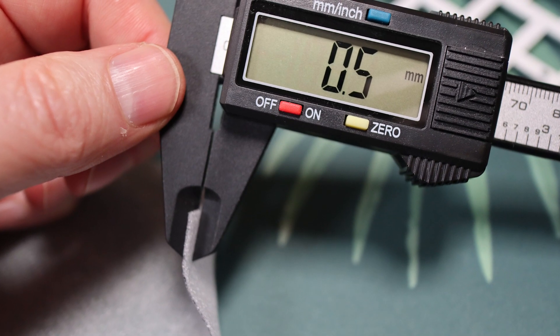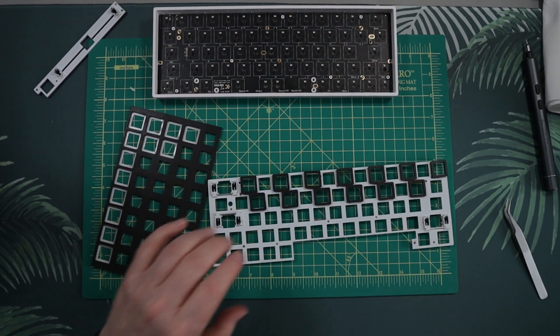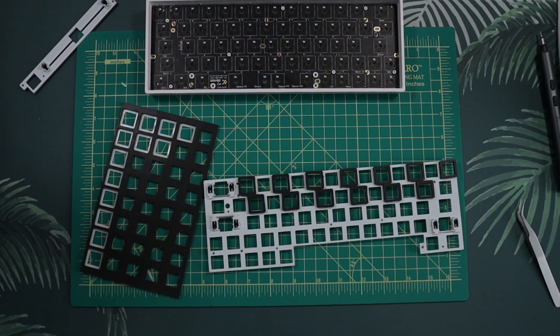Case noise — that hollow sound which comes from typing on empty space — isn't a good idea. So after checking to make sure that I could not order custom cut foam from Stupid Fish, which I highly recommend if you build something he makes foam for, I decided to cut my own foam. I first tried five millimeter thick foam, which I've used in builds before, but it was just too thick as there is very little space below the PCB. I did have some half millimeter packing foam and it works perfectly. I also chose to use some pre-cut squares from KBD fans to go in between the plate and the PCB. I'm honestly not sure what the net positive effect on sound was, but it's fun to play with and certainly didn't hurt anything.